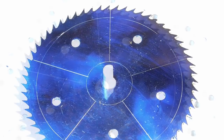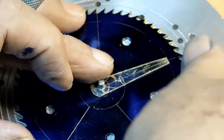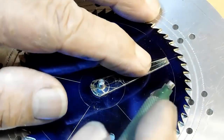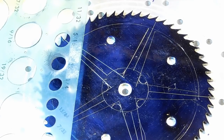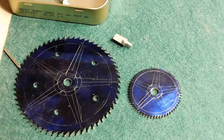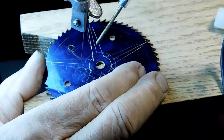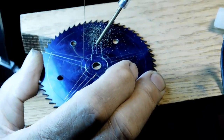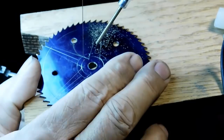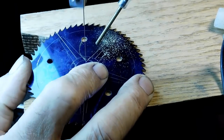There are all five, and we'll pull out the center marker and put a smaller one in. We've got our little piece of brass and now we'll make our lines for that. That'll give us our basic look, and then that template I use very loosely for the arcs — I'll be doing the arcs mostly by hand. There are the two wheels ready now for crossing. The large one is in the piercing saw setup and I'm using it to cut it out. I did a video on crossing the wheels already so I won't get into detail here, but I did it the exact same way as before.